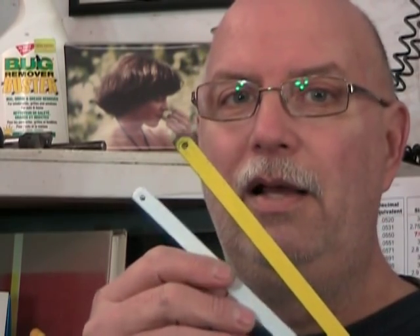This yellow one is a bimetal blade — and it doesn't mean it goes both ways. It means it's a composite blade made of two different types of steel. The teeth, the tooth portion of the blade, are made of high-speed steel — a better quality steel. The body of the blade is made of a good quality medium-carbon steel. That means this blade has excellent wear resistance and good flexibility because it's a composite — the best of both worlds. The white solid high-carbon blade has excellent wear resistance because it's hardened high-carbon steel, but it doesn't have the flexibility of the bimetal and tends to break a lot more easily.